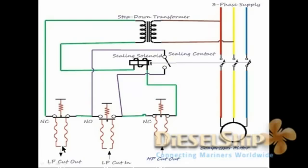Let's say it's 0.6 bar, which means the pressure on this bellow is less. So there is no sufficient gas pressure or refrigerant pressure to keep this link closed. So the spring exerts a force and opens this link. Thus the continuity is interrupted, and once again the solenoid de-energizes, opening all the contacts on the breaker, thus the compressor stops. This is how the LP cutout works.